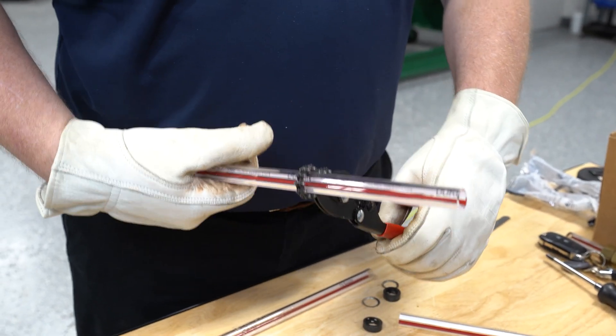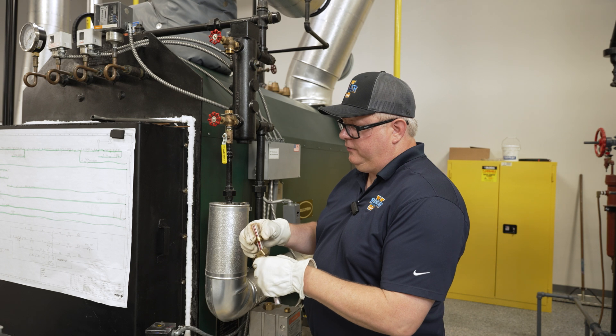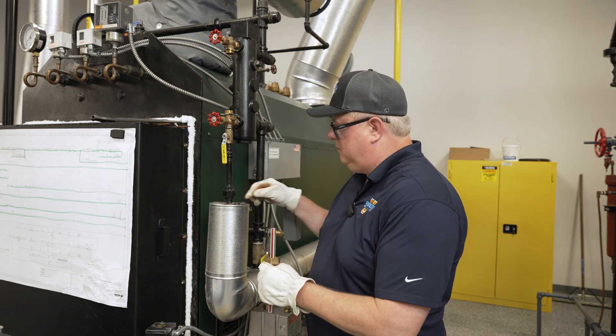Quickly snapping it. When we reassemble this, we want to go with a nut first, then the retainer, then the friction ring, and then our gasket.